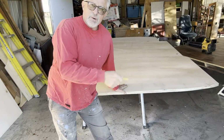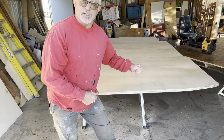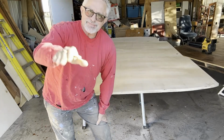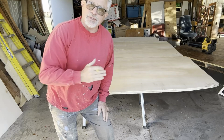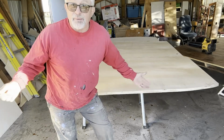Got the walls cut out. I took a big old sander, very aggressive grit on it, to smooth the edges from the jigsaw. You're not going to get a straight edge. And you don't want a straight edge sometimes, but you want it flat, and then where it curves, you want it to just follow the line. It just doesn't do that. At least not when I do it.